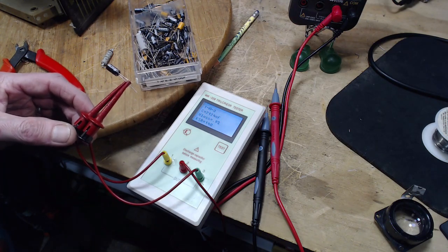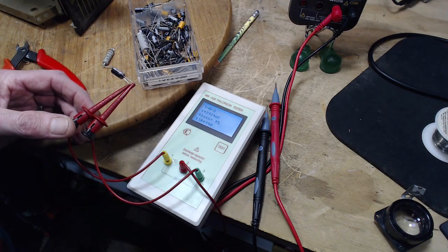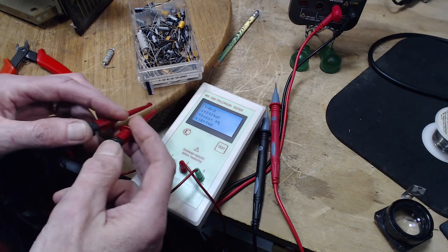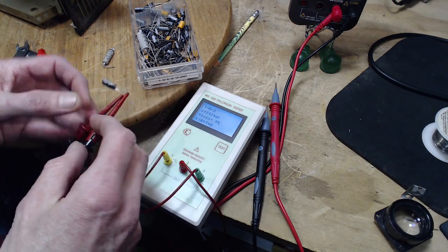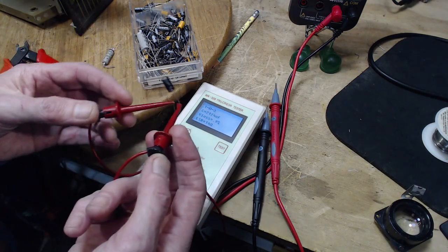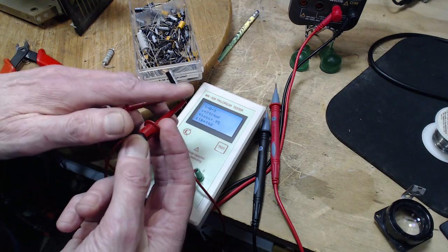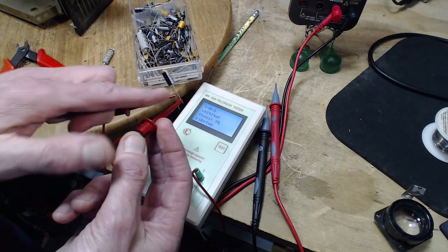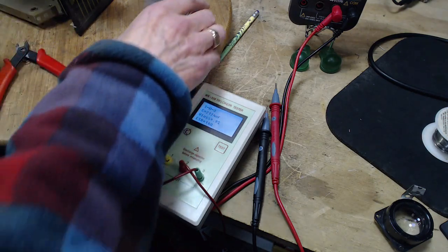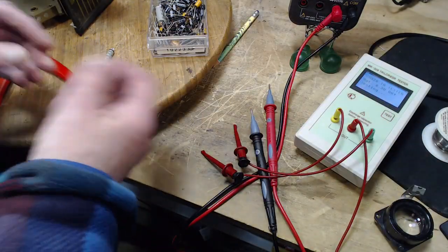So it's close. A loss is under 1%. ESR 14 ohms. Effective series resistance, I think, is what that means. It means it thinks there's a resistor worth 14 ohms in series with the lead here, so it's suggesting there's something going on in the capacitor. I don't know what to make of that. It's not, so I think this is going to be fine.